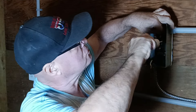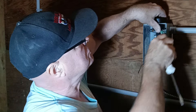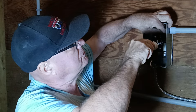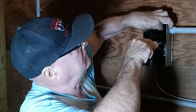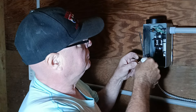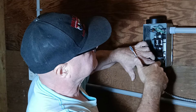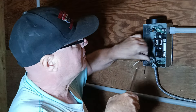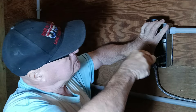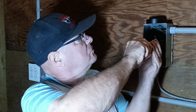Put our wire through the terminal and make sure it comes out the other end. Make sure it's nice and tight — it didn't tighten all the way at first, so tighten it up really nice and tight, then pull on it to confirm it's not moving. Now we'll put our other ground wire under this ground terminal. Push it up underneath and see our copper come up through, then tighten it up good and tight.